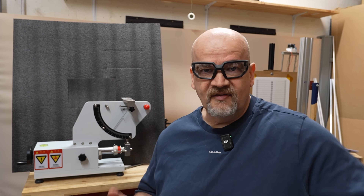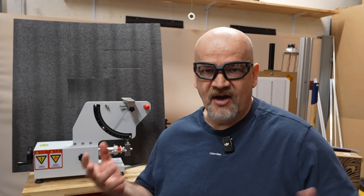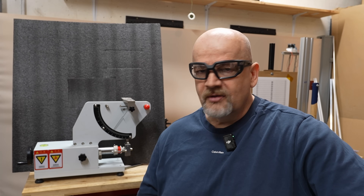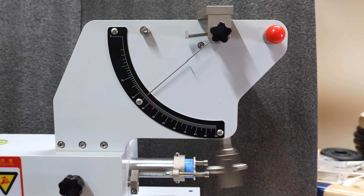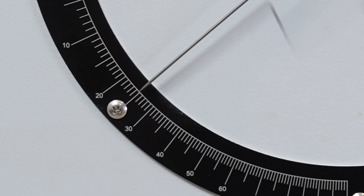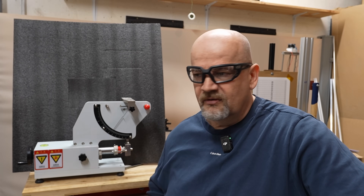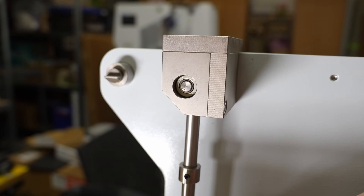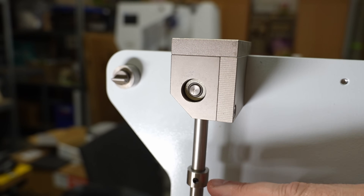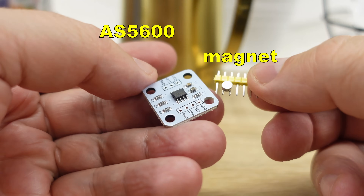Conclusions: if the material is elastic, then definitely it is measurable with this machine. Maybe I have to repeat the measuring 3 or 5 times for better statistics. I don't really like that the dial doesn't lock in place after measuring — from the vibration it moves maybe 1 degree. Theoretically it is adjustable with the screws on the back side, but it would be good if it was already adjusted by the factory. Very easily I can convert it to digital, because I already checked — the shaft is rotating on the back side and I can glue a magnet to it, and on a fixed part I can place a rotary encoder. With maybe $10 I can convert it to digital, and the accuracy would be much better without this vibration problem.